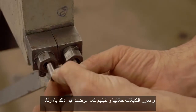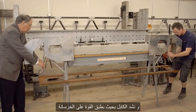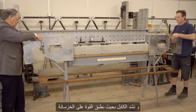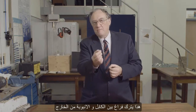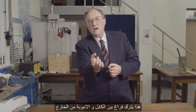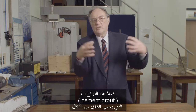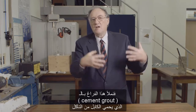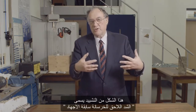We anchor the cables with wedges and stress them up, applying the force to the concrete. That leaves a gap between the cable and the outside of the duct, and we fill that duct with cementitious grout which protects the cable against corrosion. This form of construction is called post-tensioned pre-stressed concrete, because the stressing is applied after the concrete has been cast.